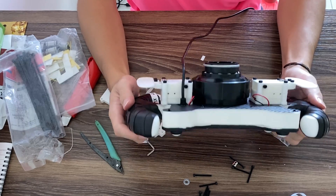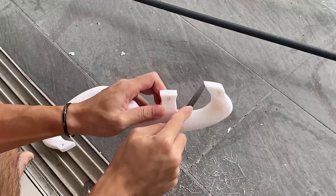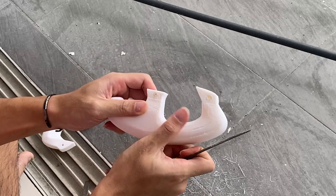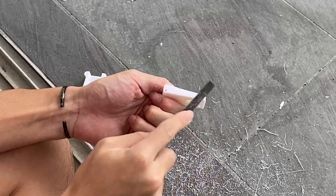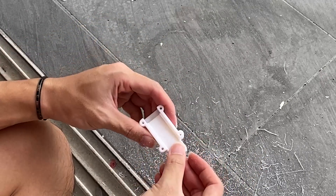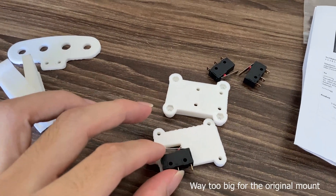All in all, I needed about $30 worth of electronics for the wheel itself, including an off-brand NRG quick release from AliExpress. Assembly was pretty straightforward, starting with filing out the 3D printed parts, especially important for the handles, as it's what I would mainly touch while racing. The shifter parts were also important to get filed down to ensure they work smoothly. A more detailed assembly guide for the shifter by AM Studio is linked in the description. I did have to make some adjustments to the shifters, as I had bought the larger KW12 micro switches instead of the KW10s that he recommended. I decided to remodel some of the pieces to fit this larger switch, as it felt more robust.